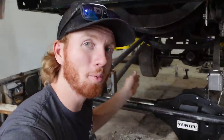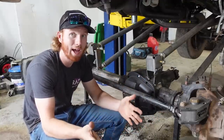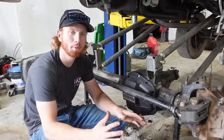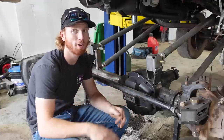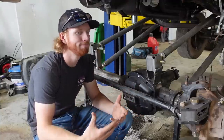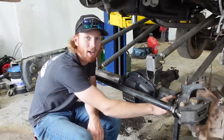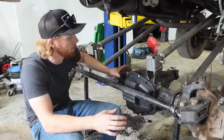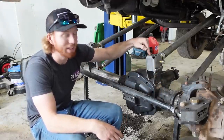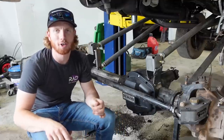To start, I'm going to get out some cardboard and model around this pumpkin, then go into the office and draw it on the computer. The alloy this axle pumpkin is cast out of is not really weldable — I mean it is, but you can't just weld a bracket to it and go. It'll get hairline fractures. What we really want is to connect this axle tube to this axle tube on the other side, because that steel is good stuff we can actually weld to. Off that bridge we can mount the upper link.